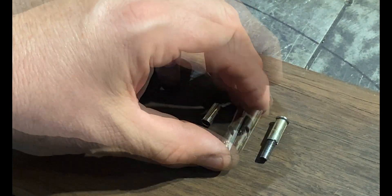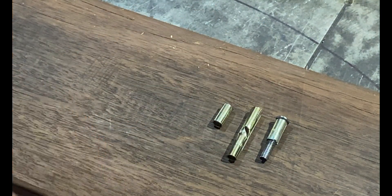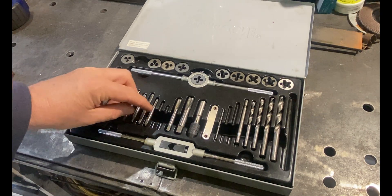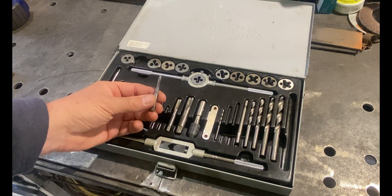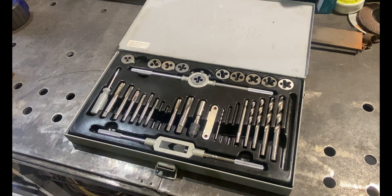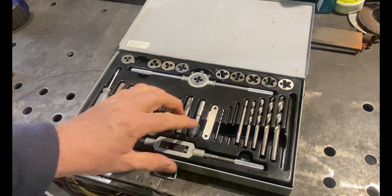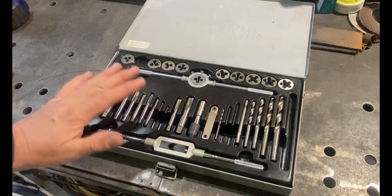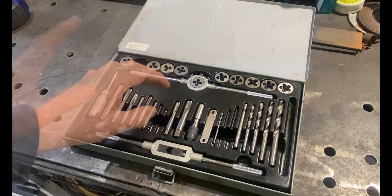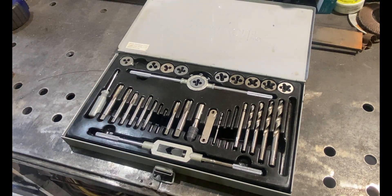Those are the items you need for your potentiometer to motor shaft connection. In this next part of the build, you're going to have to tap your motor shafts with an M4 0.7 millimeter thread pitch tap. It's a tricky process but doable for the DIYer willing to have a crack. The demonstration won't be on our actual motor shafts since those are already drilled and tapped, so I'll use a similar piece of round stock to take you through the process and principles.